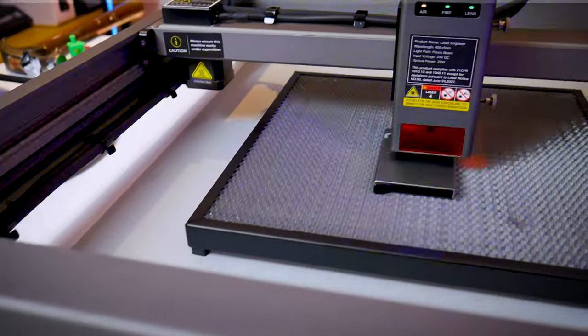The main criteria I was using to judge the settings was how much of that grayscale image can I actually see and how much is lost. In one of the previous tests I set the maximum power to 90% and a lot of the detail in the higher percentages was lost. At a maximum intensity of 75% it's a little easier to discern between the incremental steps of 5%, however I was disappointed that the border around each of those fill areas was mostly lost. In all of the tests the border on the far left side was very blurry and I don't think it was a focal length issue because this piece of wood is fairly flat. It's almost as if the power couldn't be modulated quickly enough to produce a lighter border directly adjacent to those darker fill areas. If you guys have any thoughts please put them in the comment section down below. The only other thing I can think of is that this piece of sample wood is pretty low quality and perhaps the different areas of the wood grain are absorbing the laser differently.